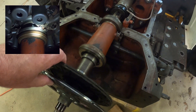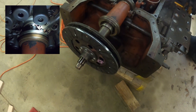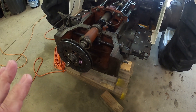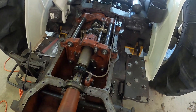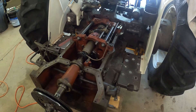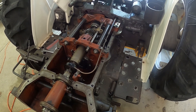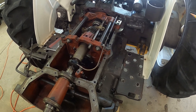As you apply the pedal further, you begin to release the pressure on the front disc, then it allows it to stop spinning as well, so that both shafts now are not spinning and you can apply your PTO system in the back. You can put it in gear. When you release the pedal, everything is crunched back together via the springs and now you're back into drive mode — both discs are turning, both shafts are turning, and everything is operating. The advantage to the live drive system is you can stop the vehicle from moving and change gears, with the PTO still running. So if you had a mower on the back, it's still spinning. The hydraulic pump is also still running, so you can lift and lower your linkage on the back.